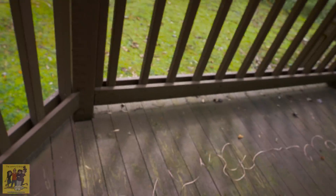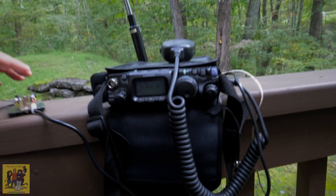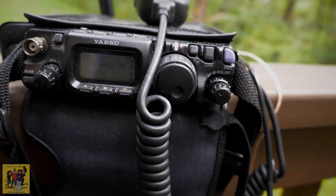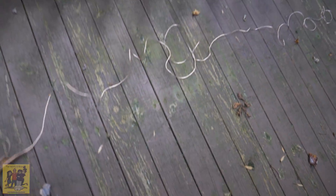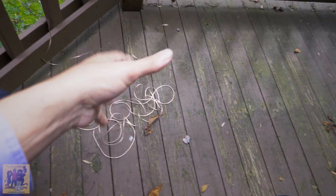I'm going to try again today. It's a little frustrating dealing with the wire — you get this little extra bit of wire that gets tangled up and you have to untangle it. But it's actually not too bad to get this thing to an appropriate SWR. Today the wire is strung out like this — this is my ground plane — and I got it just bundled up like that. When I key it, the SWR looks good, there are no lines. The other day it was wet and the situations were different, so I had to bring the wire in a bit.